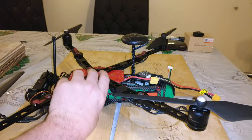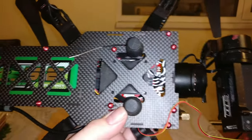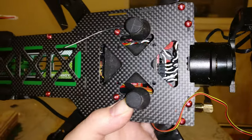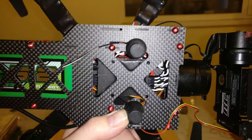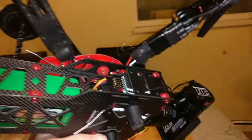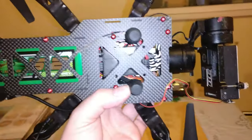Let's see if I can give you an underneath shot. You can see the 4S 5200 wedged in there. There's your Naza — M flash to version 2. One other thing to note: you do still need to use the Naza power module to power the Naza, even though the top electronics plate supplies 5 and 12 volts to all of the other ancillary equipment.